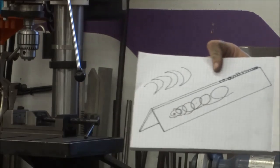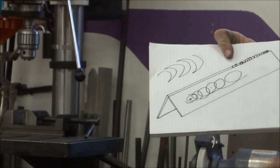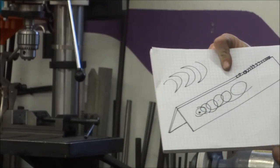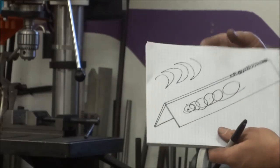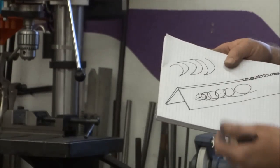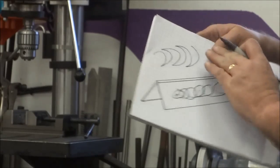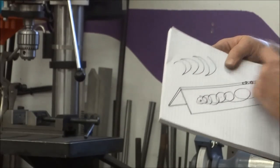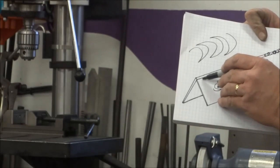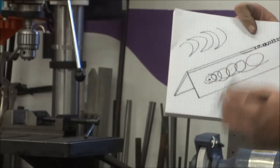Like I said before, I'm a mechanic, I'm not an artist. So, that's what I've found when I'm trying to help somebody learn this or to experiment with this technique is use a couple of 3/16 inch plate, quarter inch plate, and use an open corner joint. Stand two pieces up so it leaves you a valley, tack each end. The reason why that's easy to learn with is because it gives you basically the two edges that are going to give you guides to stay between.